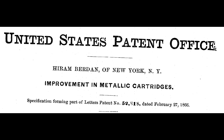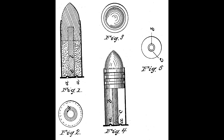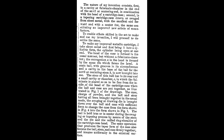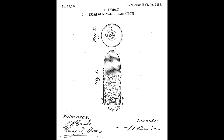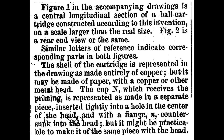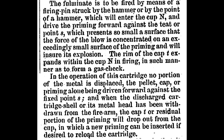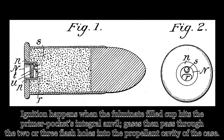In this patent, the Brevet Major General stated that the purpose of the process he introduced was the safe manufacturing of cost-effective metallic cartridges. Forming the cartridge was similar to how a rim-fire case was formed, except priming was to be done separately. Berdan went on to perfect the concept with the release of a second patent in March 1866, in which he explained how the external primer cup was to be constructed and filled with fulminate separately, to then be inserted into the case's primer pocket and sealed.